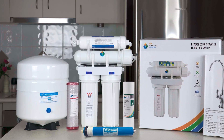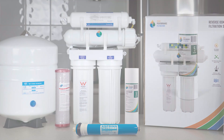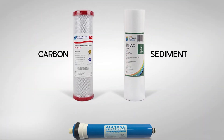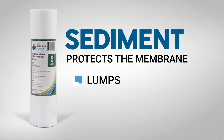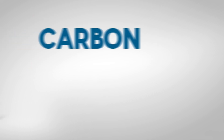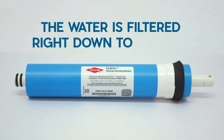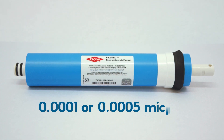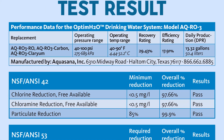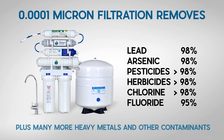The first three stages are generally for filtering all of the contaminants from the water. It is usually in the order of sediment, carbon, and then the reverse osmosis membrane. The sediment protects the reverse osmosis membrane from lumps and bumps and dirt in the water, and the carbon protects the membrane from chlorine and its byproducts. Then as the water is pushed through the reverse osmosis membrane, the water is filtered right down to around 0.0001 or 0.0005 microns, removing almost everything from the water, including the minerals.